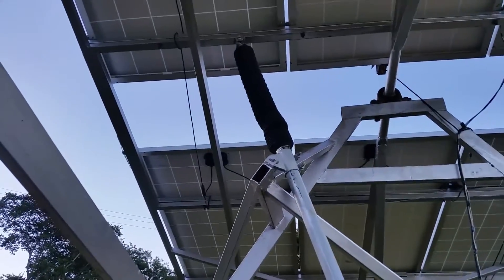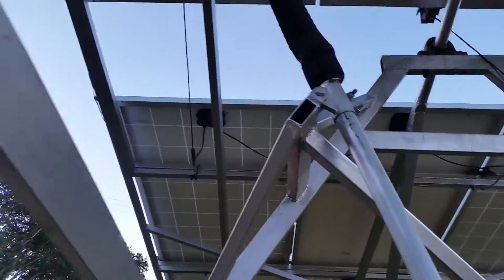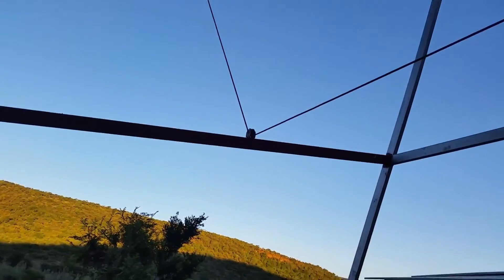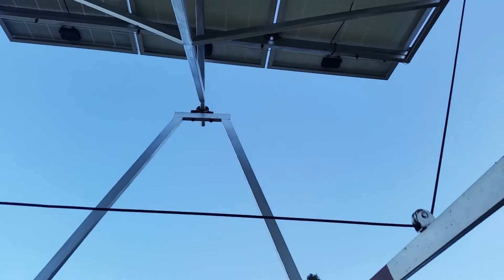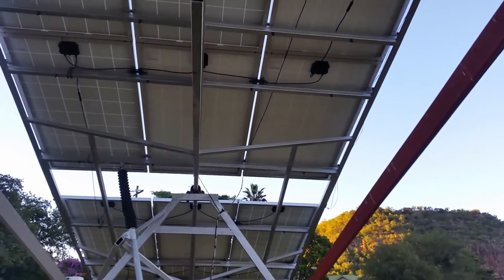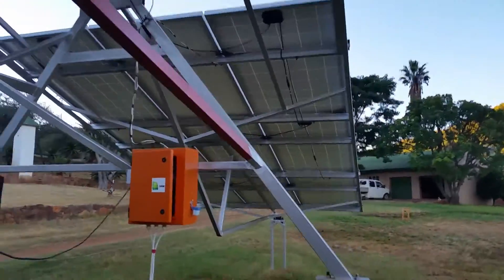I bought a new actuator that can lift about 6,000 newtons — so about 600 kg. I've got a steel cable reinforced setup just to always have some tension on the solar panels for strong winds. It turns with the panels and keeps the tension for high winds. I don't have a wind sensor so I'm relying on mechanical reinforcing. I know it's very strong because when I built this I could actually walk on the sides when putting up the solar panels without bending anything.